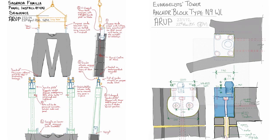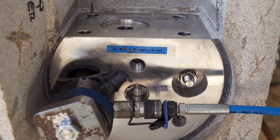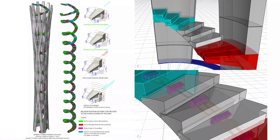On site, this is a lintel block — the big block that goes across the top of the panel. These steel pieces are all accurately glued with epoxy glue into holes. This is the most delicate bit structurally, because when you pre-stress it, these tend to burst the stone. So all of these have to be accurately made — they've got curved surfaces — glued in, and then we hydraulically pre-stress the rods. Here you see the actual prototype of the tower itself: putting together real pieces to see if they fit. We are getting one millimetre tolerance on the fit-up between stone panels. The piece we're looking at is what's called the nucleus, or core, in the main Jesus tower. When the church is finished it will be 170 metres tall — the tallest church in Europe. The nucleus going up the middle of the main tower is itself 60 metres tall, with a spiral staircase cantilevering inwards from the stone core.